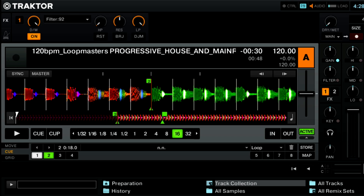The next knob we have is the high pass knob, which is abbreviated to HP. You want to start this all the way to the left — it's going to be passing all of the frequencies to the right of it. As you turn the knob to the right you're going to be filtering out all of the frequencies below the point of where you have the knob, and it's going to just be passing everything to the right. Once you have it set all the way to the right position, you're not going to hear anything.